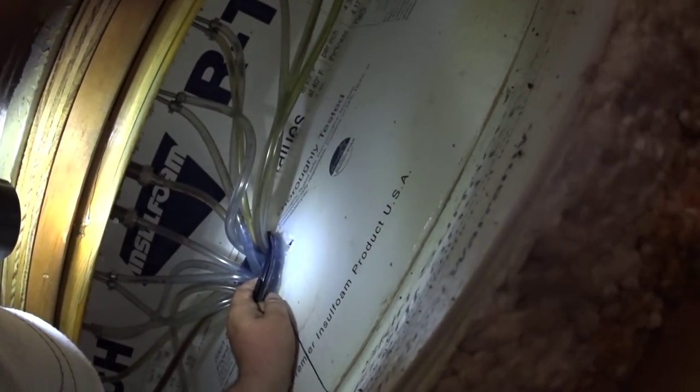Taps all come through the wall here. This is a cooling duct, circulating fan inside of the cooler to bring cool air in to keep this part of the box cold. Eliminates us having to use glycol. Keeps the beer lines cold. No solenoids or stages that I can see. Just over tapped. The box is nice and cool.